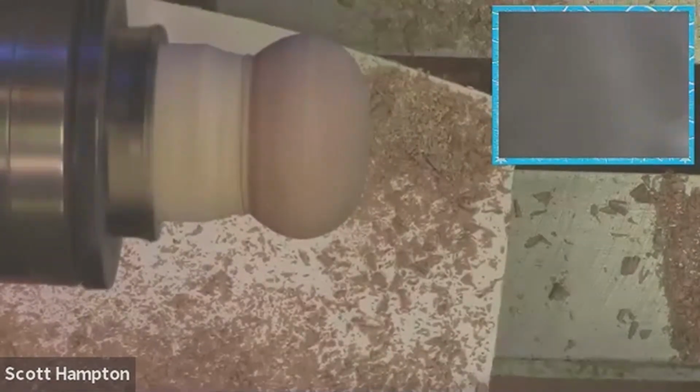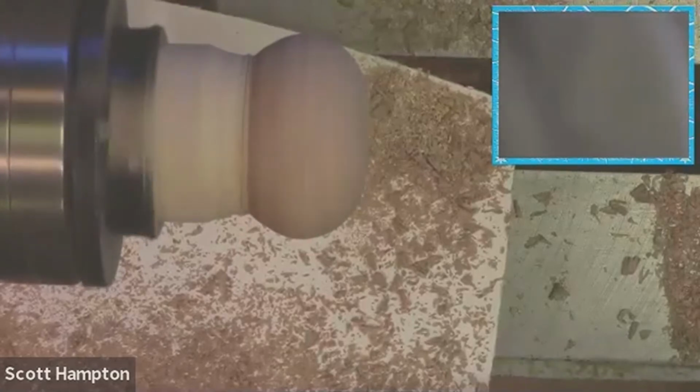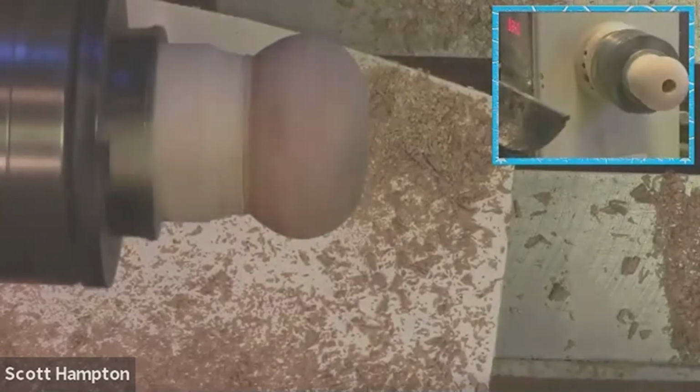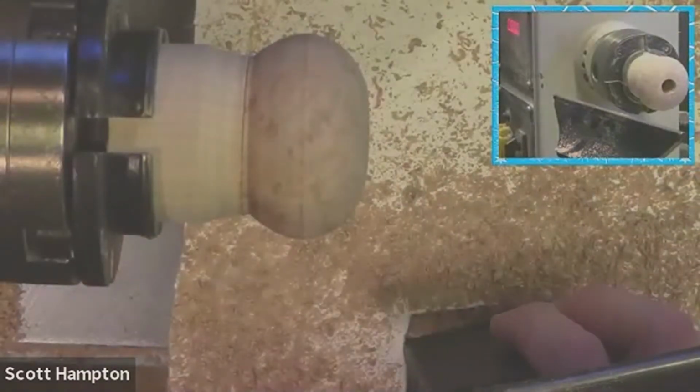And I'm going to take this chuck out of here. I don't need my arm getting jabbed by that point of the drill bit. Okay, so the Forstner was 5/8 and the twist drill was 3/8. Yeah, you can use a 3/8 or an 8mm. Okay. That's what usually works well for me.